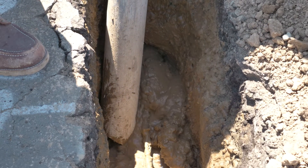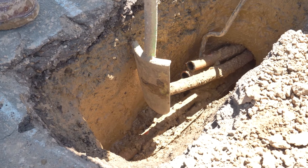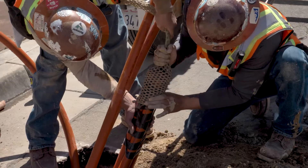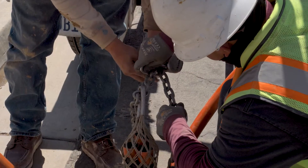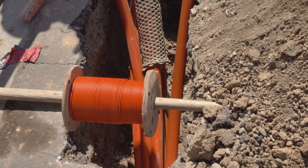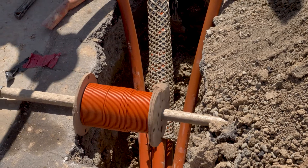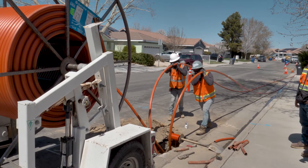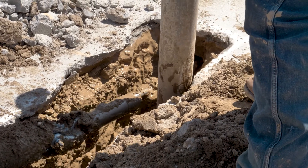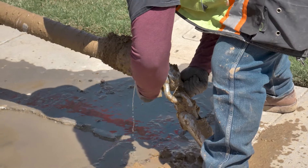The marked conduit has arrived at its termination point. A finger trap is added to the end of the marked conduit and secured to the trailer in order to hold it in place. The operator continues to pull and the marked conduit stays in place, while the rest of the conduit continues its journey to the beginning of the tunnel. Once the conduit has arrived at the end of the tunnel, the boring machine can tunnel the next length.